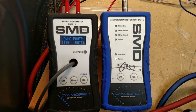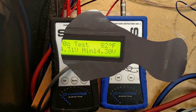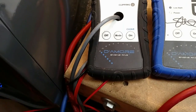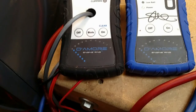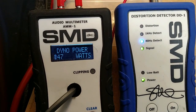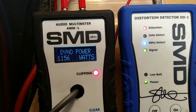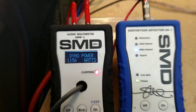Let's go ahead and try an uncertified test. I'm going to retune this with a 10 dB overlap and that should bring us up to clipping. We'll reset back at 2 ohm. I have the amp retuned. This is going to be 2 ohm uncertified, 40 hertz. Let's see if this thing will squeeze out a little bit more power. Not much more — 56 watts more.